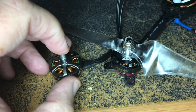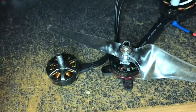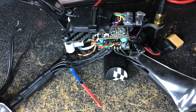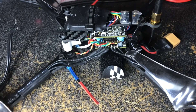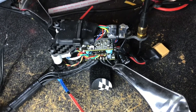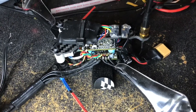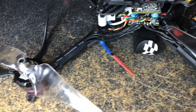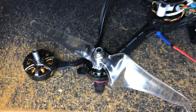These are 1900KV, these are 2300KV. I went low on the KV because this is the Mamba F405 stack — it's a 20-amp ESC — so I figured I'd keep the KV low. This is more of a long-range cruiser, so I'm gonna take it easy and make sure we don't overload that 20-amp stack.